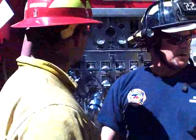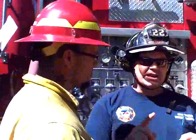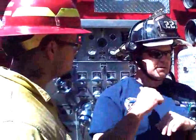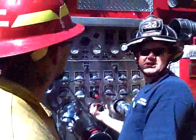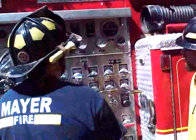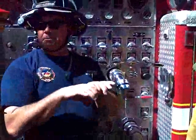We're running pressure right now. I want to supply a truck. Whenever you're running a structure fire with this nozzle running, you never want to change from high pressure to volume because that's going to change what he has out there. If you're just supplying another truck at a fire, watch what happens with the pressure when I turn this from high pressure to volume. Right away, you dropped 30 pounds — I dropped 30 PSI.